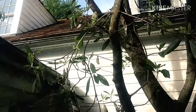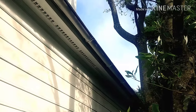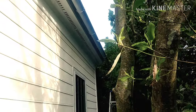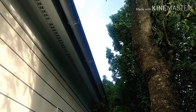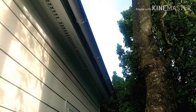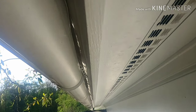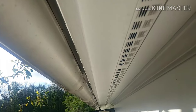The gutter in front of me right now, snow took it out. It has a circle, a shank, a nut, and a bolt. What you're looking at right now is a circle, a spring clip. If you look underneath of it, the gutters are kind of leaning forward. It's pushing that shank — the straight part behind the gutter — almost into the fascia board. That's supposed to be parallel with the fascia board, so it really messes with the pitch of things.